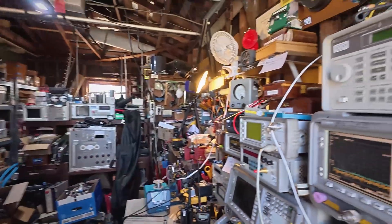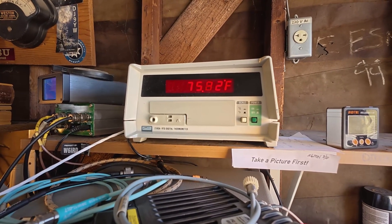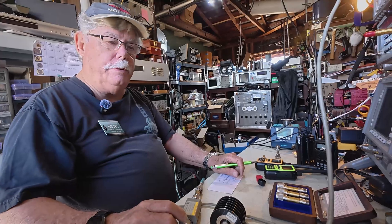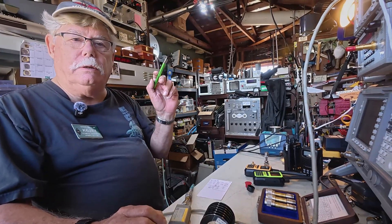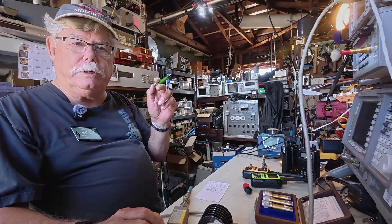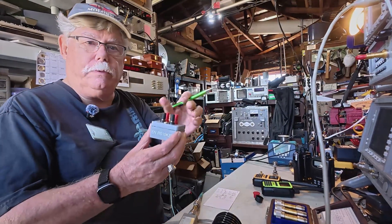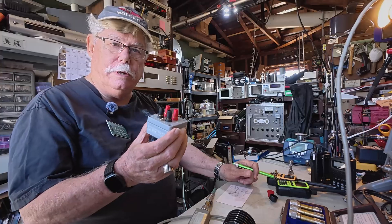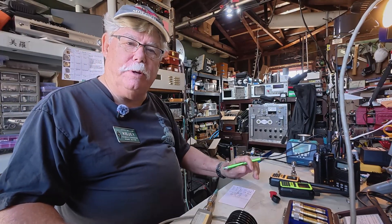Here's something most labs don't do. That's an RTD thermometer, and it is in fact 75.81 degrees Fahrenheit at the surface of my bench. There are a couple of measurements that require accurate temperature measurement, like noise figure. This box here is a noise figure meter, and if that is off by one degree, it goes off by one-tenth of a dB in noise figure — and for microwave and EME stuff, that makes a huge difference. Temperature is also a bad factor in resistance. I have an expensive resistance standard here — just one little resistor — and at 23 degrees centigrade it's perfect, but every half degree off and the reading changes. So you end up with an expensive thermometer instead of a good resistance meter.